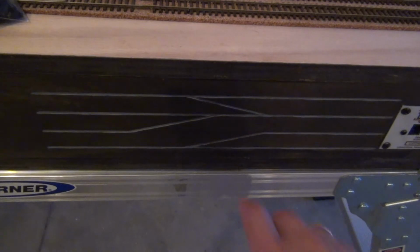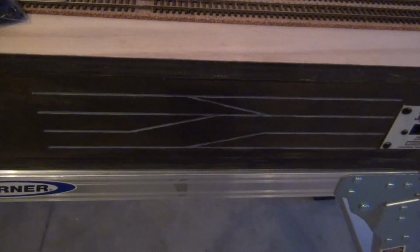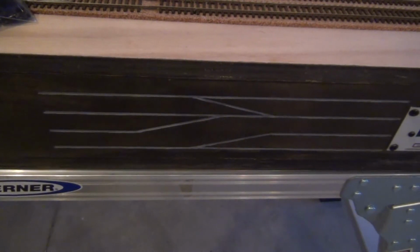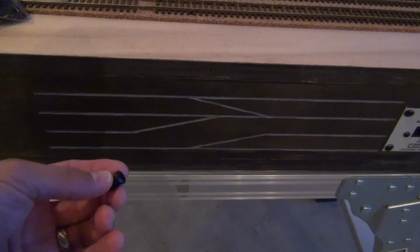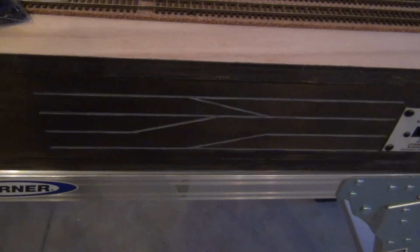So looking at my track map here, I'm going to drill a hole right where all 4 turnouts are at, and then there's 8 detection zones. Here's 1, 2, 3, 4, 5, 6, 7, 8. So I'm going to drill 8 holes for the detection zones, and then right over here above my UP5 panel, I'm going to drill 2 holes, because the BXP88 has 2 zone power outputs for LEDs, and those are critical because how those flash will tell us if there's a short, if there's any kind of an issue within that detection zone. You have to pre-measure the size of hole to make sure that your LED holders fit. These particular ones are 3/8 inch bits, so I'm going to go ahead and grab my drill, get these drilled out, and I'll come back and we'll start assembling our LEDs.